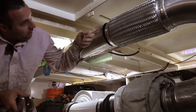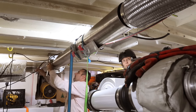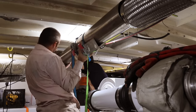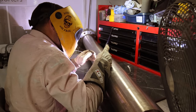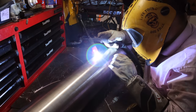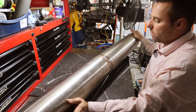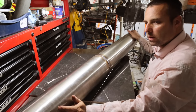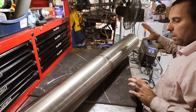There's something incredibly satisfying about stainless welding when you've got all the fit-up great and everything's just perfect and you can smash out a really nice TIG weld. That's not necessarily what happened here, but that's what I'm going to pretend happened. That's welded all the way around - some of the welds are a bit questionable, but they will do. I don't think I'm going to see any leaks. We're going to smoke test this rather than try pressure testing, because I don't have the equipment for pressure testing. So we'll basically assemble this back up and start working on the next part that goes around the front of this pipe.